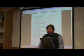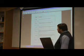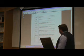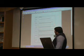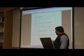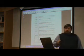Some of the enclosures will carry multiple ratings. Type steel enclosures would usually be 3R or 4. If you wanted a 4X steel, you're going to go to a stainless steel. And it just deals with what type of environment it's going to be in.